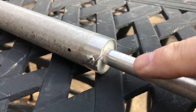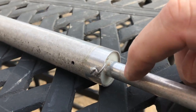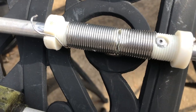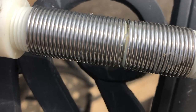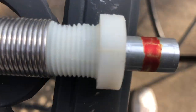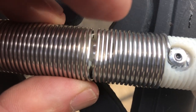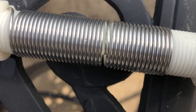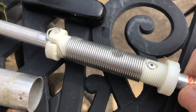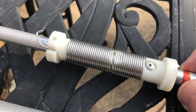I slid the seal back and there's a little bit of stuff here — it could be causing some sort of a path. The way I understand it from Mosley, I remove this screw, disconnect this wire, that disconnects the coil on this side, and I should be able to simply pull this out. I pulled the trap apart and look at this — it looks like the form is cracked, and there's a dent on it. I don't know how that happened. I did notice a little bit of moisture on the coil, and when I took it out there's a little bit right here. Disassembling the other side, you'll see there is still a dent but the core is in one piece — nothing's cracked like on the first one. So I'm thinking this is my problem: this form for this trap is broken.